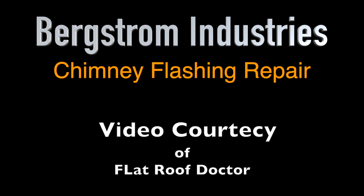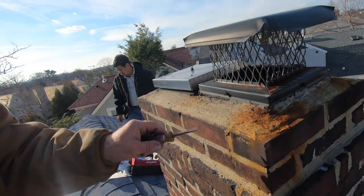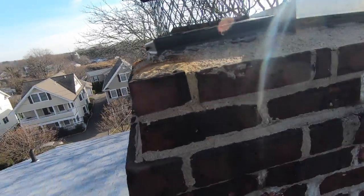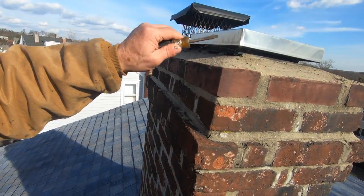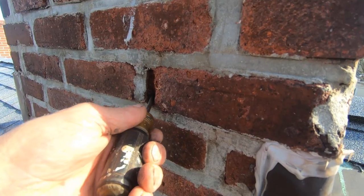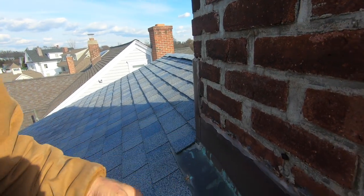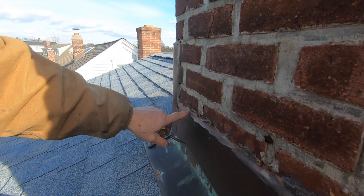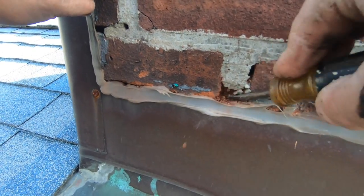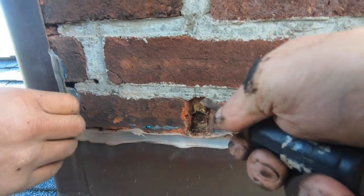Let me show you — like I did on other chimneys — this chimney looks good normally. You check for problems, cracks. This is okay, this is okay. The cement, everything is fine here. But then you go down and there's spalling. Something went wrong here with this brick, so somebody came and put silicon caulking. Look at this — it's just breaking apart. That didn't solve anything.